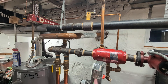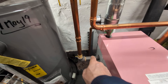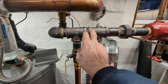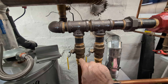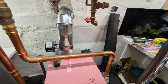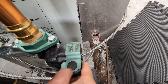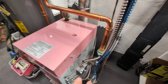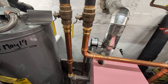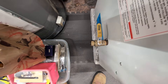One way of dealing with tying a 21st century boiler onto an early 20th century hot water system is to use a technique called primary-secondary piping. In this case, the outlet of the boiler is inch-and-a-quarter, and we go up to what are known as closely spaced T's. The flow of water goes up into the T, and some of it is taken back out through the circulator here — which is a 007, the electronic type with permanent magnets — and sent back into the boiler, so there is constant flow through the boiler when the system turns on. We've got isolation valves here for servicing the boiler and a properly sized drain valve.